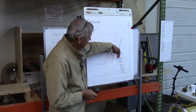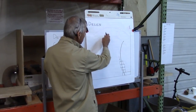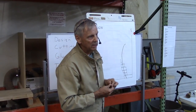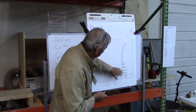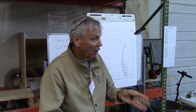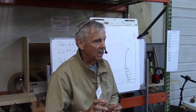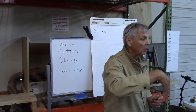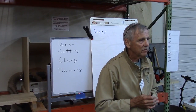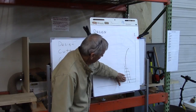You do all the outside dimensions one quarter inch line to line, and all inside dimensions five-eighths inside the line — maybe three-quarters for a big bowl. Within just a few moments, you can lay down a bowl with all the sizes you need. You know the outer radius and how thick each piece of wood is going to be, all off a single-line drawing. For bowls between five and eight inches high and five to eight inches in diameter, they're easy to handle on the lathe, don't take much wood, you don't need any steadies, and that size tends to be marketable.